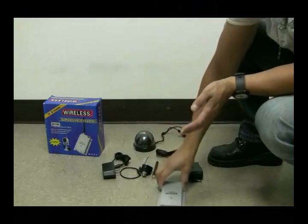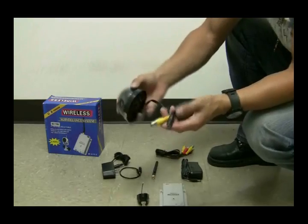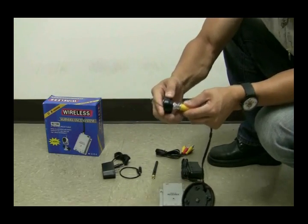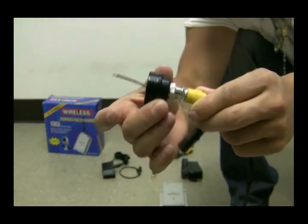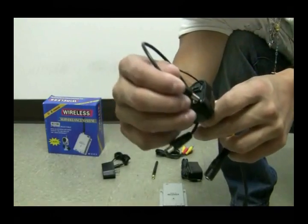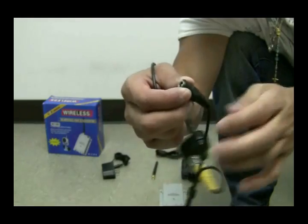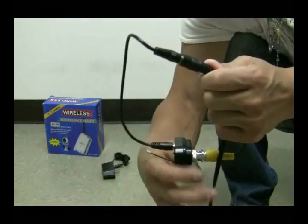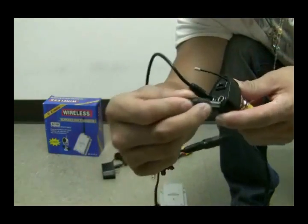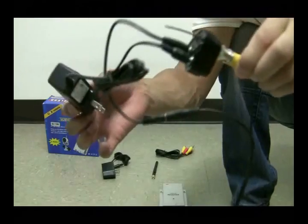We have the receiver and we have the transmitter. For example, this is your camera — let's use a regular dome camera. The transmitter will connect to the video out of the camera. You put it in and twist lock so it gets locked in place. Then it has a small power pigtail on the back. This one will connect to the power of your camera, and the other power adapter will connect into the other plug of the transmitter. That way, with one power source you provide power to both the transmitter and the camera itself.